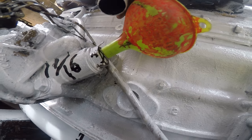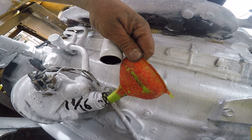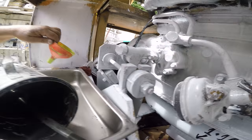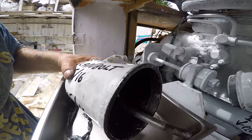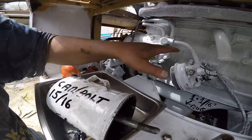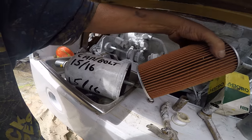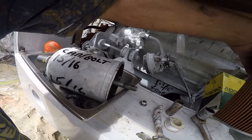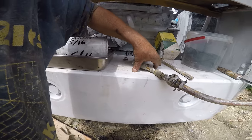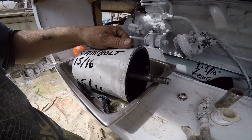Once the canister is on and you're ready to put the oil in, you will take that plug out and put a funnel apparatus into the top and you will pre-load this entire canister, which takes approximately a half a gallon by the time it fills up the upper chamber. So you would put the filter inside the canister — you will not put oil in there yet — then you will put the canister on.